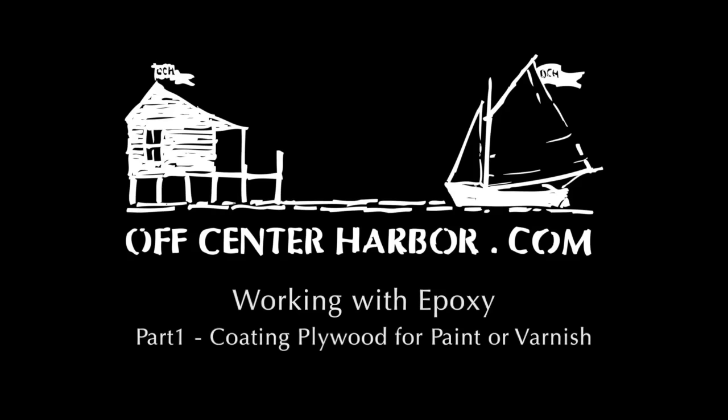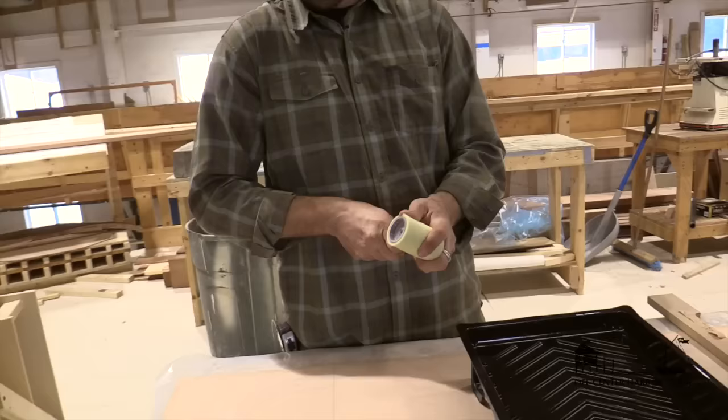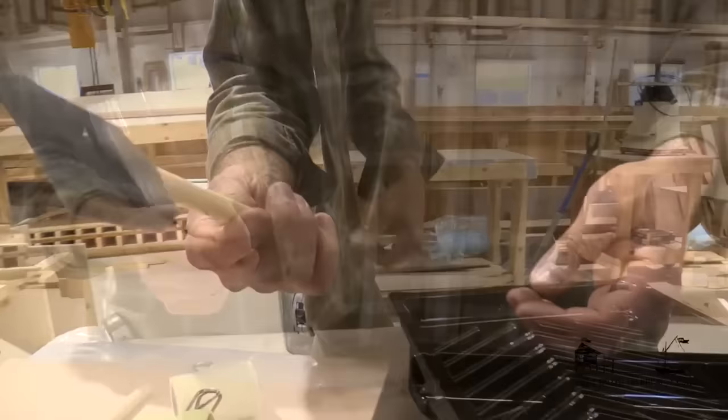Let's start with how to clear coat with epoxy and create a beautiful, smooth, waterproof surface for surfaces that are going to be painted or varnished. Some things you may want to have: the roller we use for epoxy work in the boatyard is a very thin nap foam roller. The thicker these get, the more texture you tend to make. For finishing epoxy clear, we use something like this — these come in seven-inch for a typical roller cage, but this is just a small three-inch. We also use a stock three-inch foam brush for tipping out, and a chip brush for tipping as well.